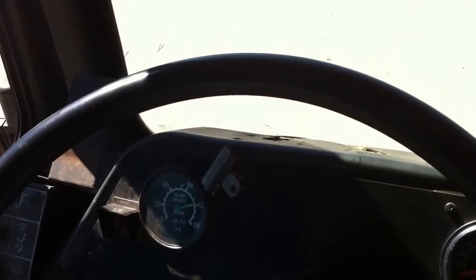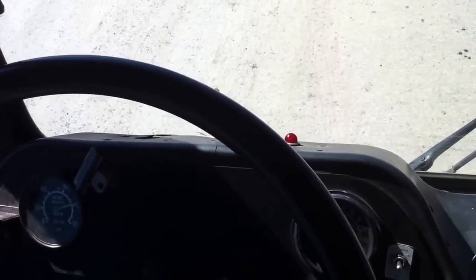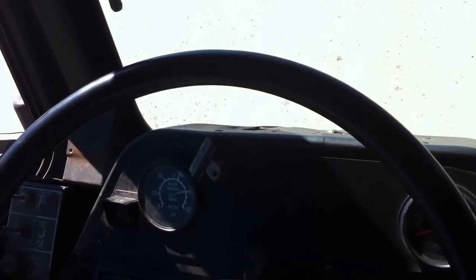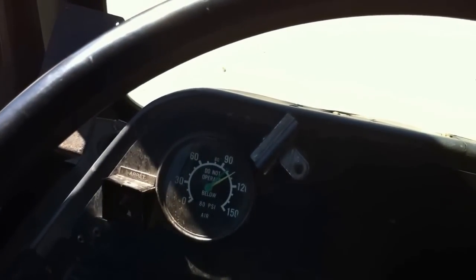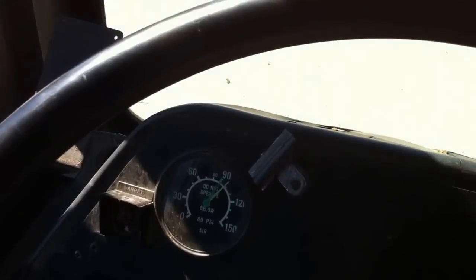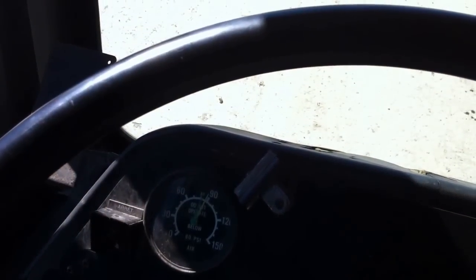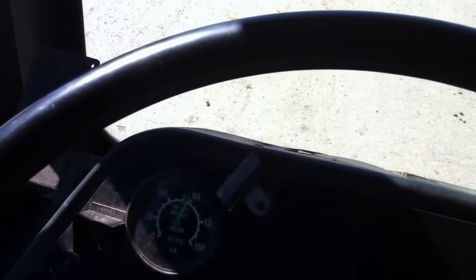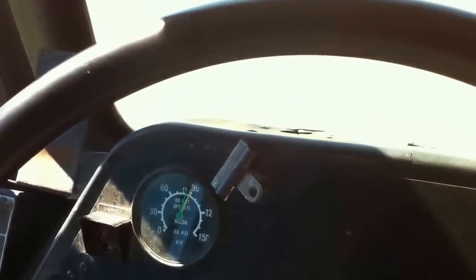At this point, we will now start the engine, keeping our foot on the brake and the emergency brake off. We will now bring the pressure down to approximately 90 or slightly below 90 psi's, around the 80 mark. At that point in time, the compressor should start operation. So slightly below 90, right above 80. Watch the needles. Compressor has started operation. If it does not start at 80, that will be a minor defect.